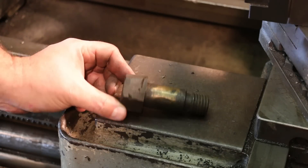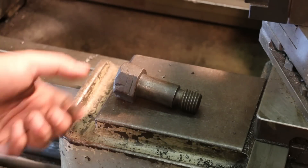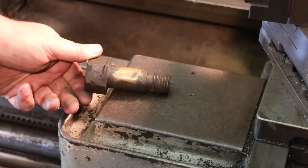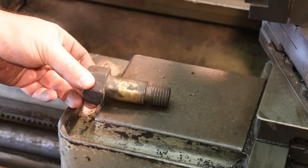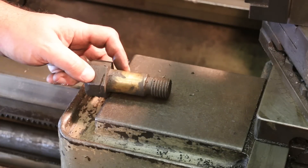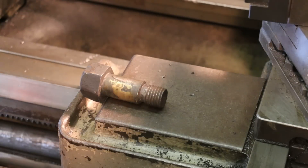Years ago it may not have had that clearance — I'm not sure — but it was really difficult to get a wrench down there. This is inch and five-eighths hex, but it's all boogered up all the way around. Number two, if you look right in here, this is steel and this is bronze. Evidently at some point this bolt had become so worn that somebody brazed it up and re-turned it. This thing is totally out of round — it's not true. It's supposed to be an inch and an eighth in diameter, but it measures anywhere from an inch hundred-thousandths to an inch hundred and fifty-thousandths — about fifty-thousandths out of round all the way around.